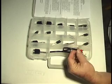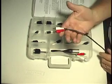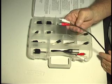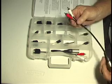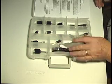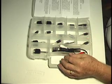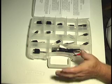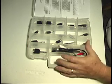The wire inside the cable is primarily designed for input signals, which are small. And the wire, although it's a good gauge and it's copper, reaches a limit whenever you're talking about running speaker level, because you get quite high signals there. And then of course turn off any phantom power. It doesn't operate with phantom power, so there's really no reason to run it.